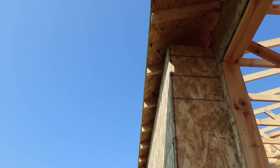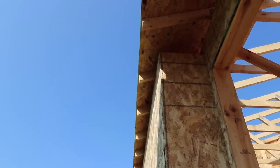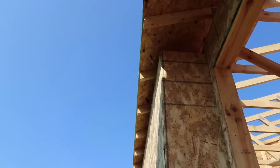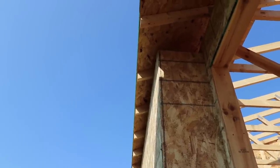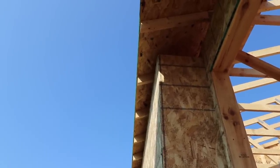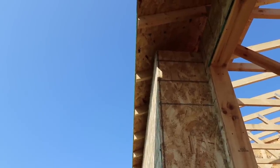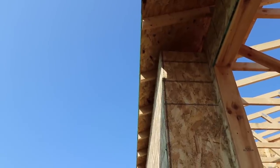you can see how that plywood hangs over a half inch. I hooked onto the end of the tail, went up 47 and a half because I wanted that to stick past just a little bit. Now I can take my 2x6, come up on a ladder, and just slap it up against the plywood and not have to try to get the right angle with my speed square so that I don't go above the roof. Anyway, it's just easier for me to do it this way.